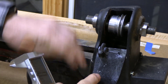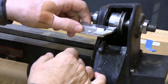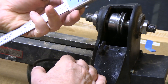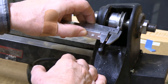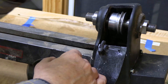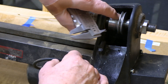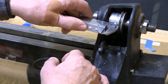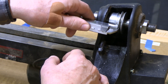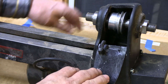This is where the belts would ride. I took my caliper and measured the width of the pulley, which will be the diameter of the belt. I got about 4.78, or about 5 millimeters. That's consistent with the other side too — this one is a little bigger, about 5, and the other is 4.5 — so approximately 5 millimeters. I thought it would be a good fit.